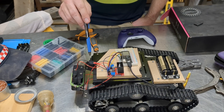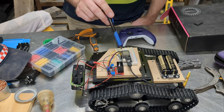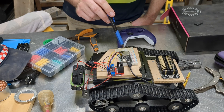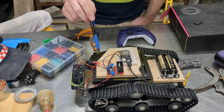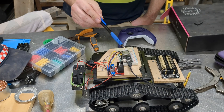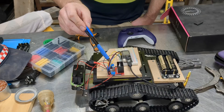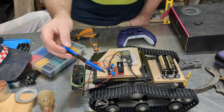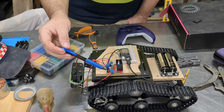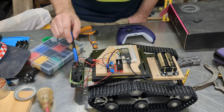Now looking at the back for the motor drivers — I'm learning electronics as I go. One thing I learned is that you can't power the motors directly from the ESP32 because the motors will draw too much current and you'll end up frying it. You have to separate this concern and delegate the driving of the motors to a separate board. This red board here is a very common, cheap board — under $5 — it's the L298N, and it allows you to drive two different motors.